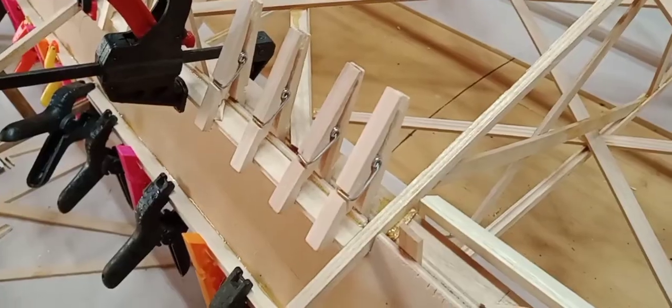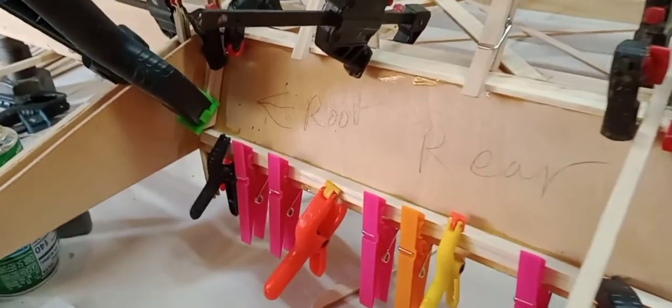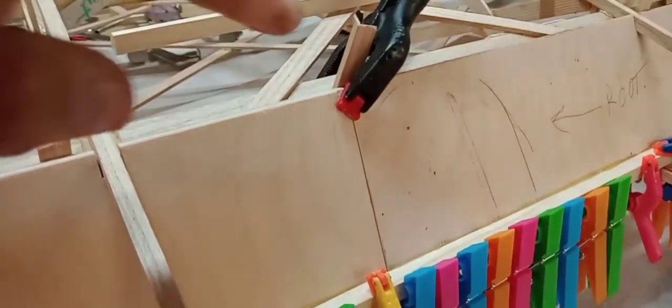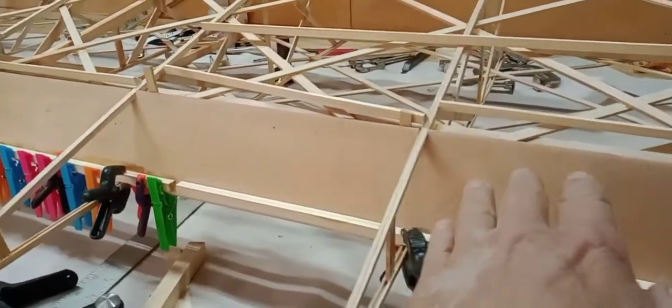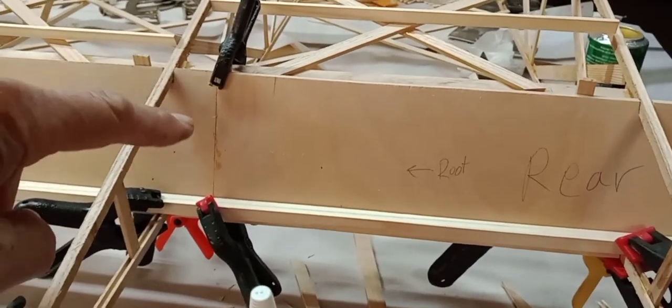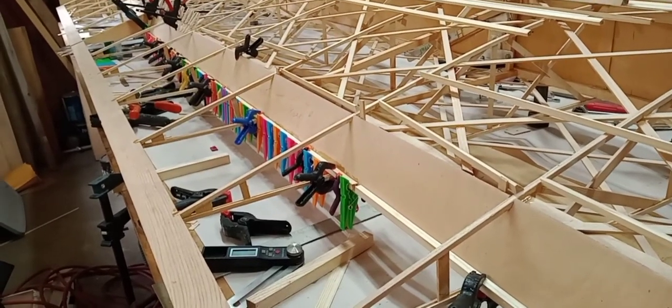Okay, we're at a point where we can stop. I just ran out of the glue pot that I'd mixed. Before you walk away, make sure that everything is secure and aligned — like we made these butt joints, so you can't just ignore the butt joints. I put a clamp up here just to make sure that's even, and further out I put clamps on the bottom just to hold this piece up into place. We glued up that butt joint there too, so we had to push it up into position and make sure it was clamped in place. Now we can go take care of birthday stuff for the day — lots of grandkids, lots of birthdays.